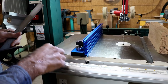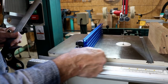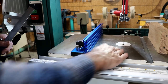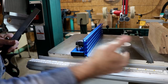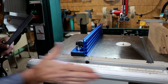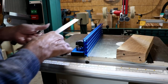Now I'm going to make something that will square this. They recommend just using a square on the front of your table. Now this table, unfortunately, has two offsets, and the offsets are machined square to the table, but the rest of the table is not. Because of those offsets, you can't just put a square here, because the square would be doing this. So I'm going to make a special square that comes all the way back and grabs on this bar. In fact, I'm going to use this as the grab here. Anyway, it's going to be a homemade deal. I'll show you how I make it.